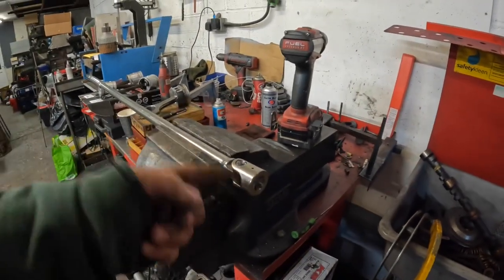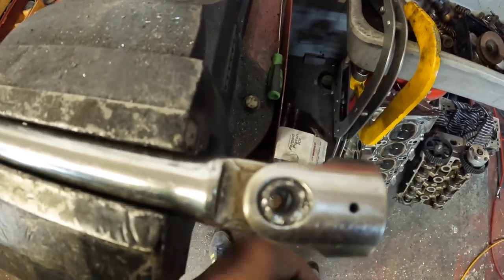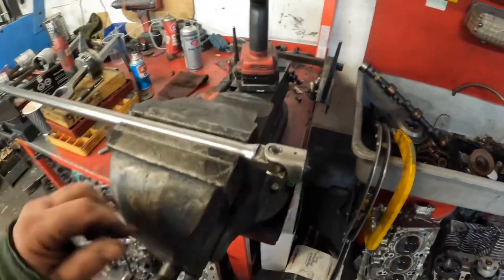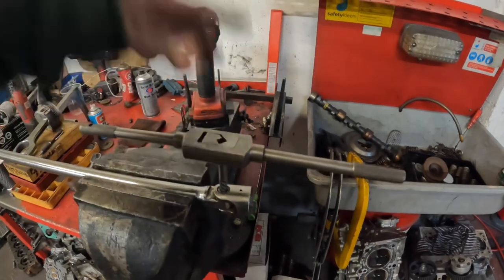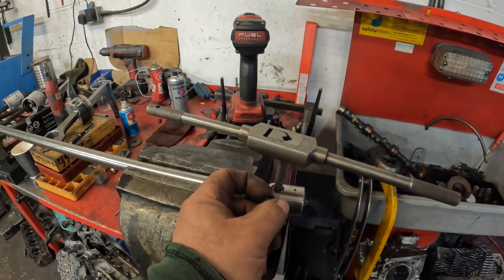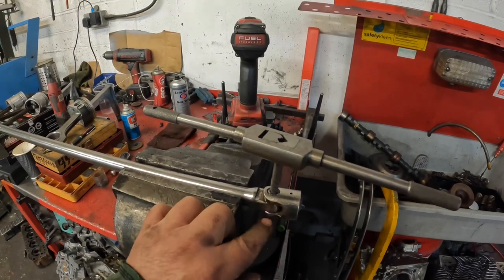What I need to do is remove the damaged pin, tap the square drive out, and put it all back together. I've managed to get a hole all the way through — as you can see with my finger there — which was quite tricky because it's a hardened pin or hardened screw that goes through there. The next thing I'm going to do is use one of my Snap-on tapered stud extractors. I don't always like these because on a normal stud they make the stud splay out and bite harder into whatever it's stuck into, but with a hardened screw they're actually quite effective.